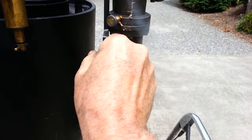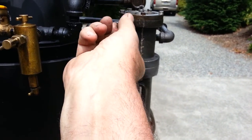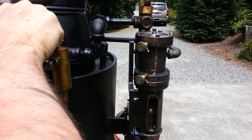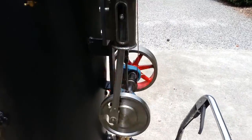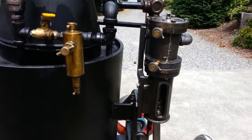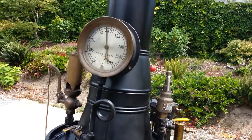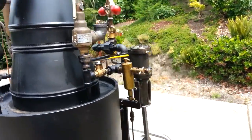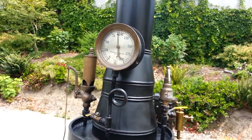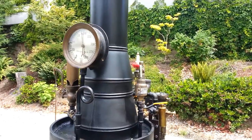You can pull them down. That's a good RPM right there. Right now there's about 40 pounds — no, it's up to 80 pounds of pressure. Now your pressure will go down, and if you're managing the fire correctly, it'll hold steady at 50 pounds of pressure in the boiler while you're running the engine.